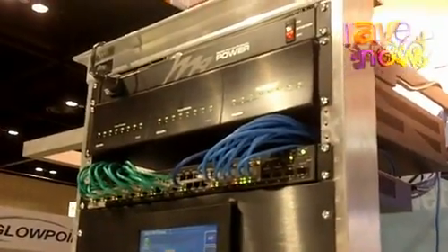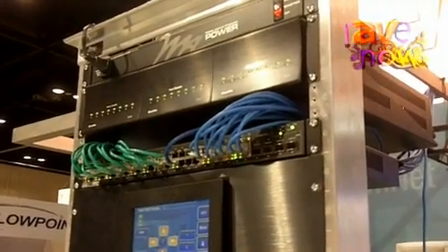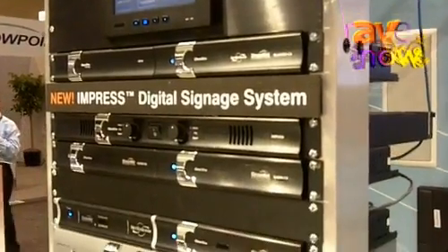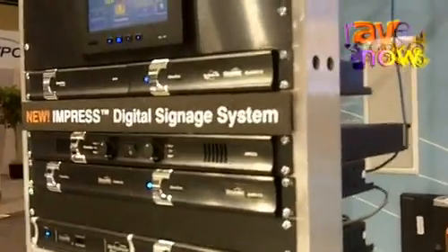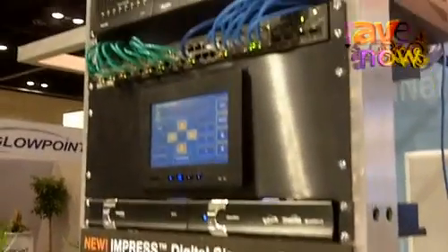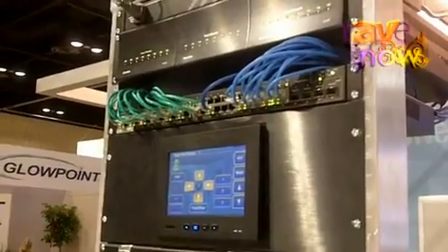What we have over here is the flexibility of starting with one or two encoders using an Ethernet switch and a Layer 3 protocol called Internet Group Management Protocol — IGMP. The switch acts as the virtual matrix and basically the gatekeeper of where the multicasting traffic goes.